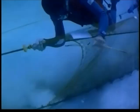Two other measurements will be determined for each net. The first is the drag of the trawl, or tension in the towing cable. This is the actual amount of tension in the cable caused by the drag of the net, doors, and bridles through the water. Part of the efficiency of each net type is its drag because this drag affects fuel consumption on the vessel. The second measurement for each net will be twine area.